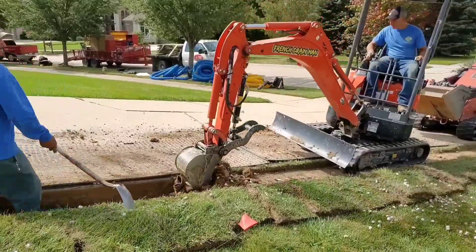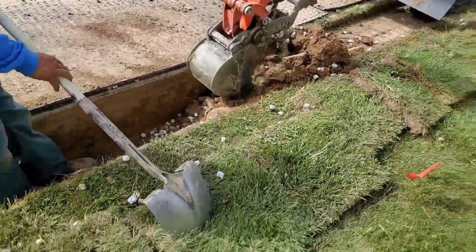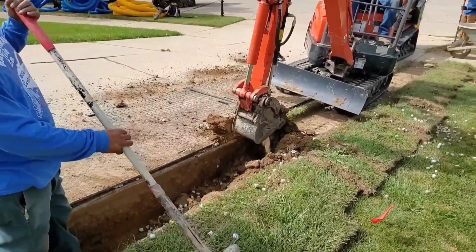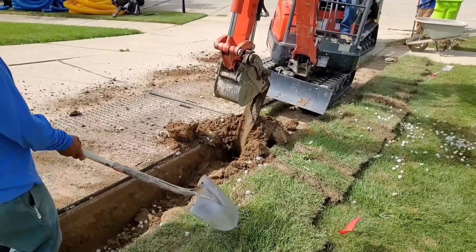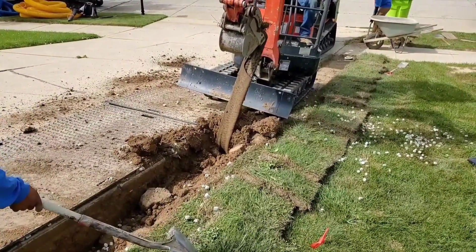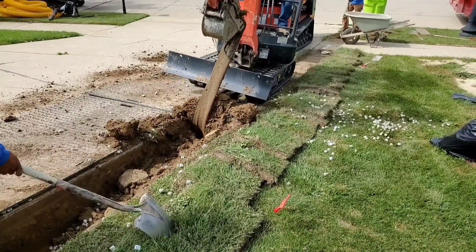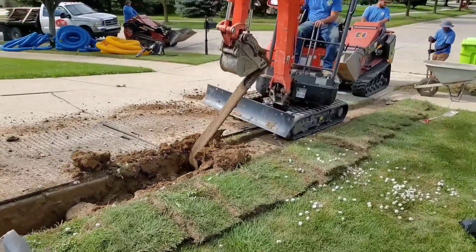When we did a bunch of testing and had to give dimensions for our videos, we found this drain is only seven inches in diameter. Can you believe that? Only seven inches, and you've got a four-inch pipe in the middle with an outside diameter of four-and-a-half inches - so there's not very much styrofoam to begin with. It's no wonder these things don't work very well.